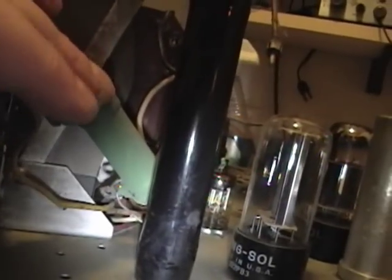Here's the high voltage section that was giving me trouble. There's the fuse down below that kept blowing. I've been inspecting this — these two resistors up here were a little puzzling until I realized that the upper one has actually no connection to the top at all. This is apparently the old original one and when I measured it, it's open. This must be an old repair where somebody bypassed it with this green resistor, which is pretty close to the right value.